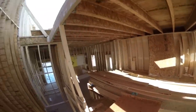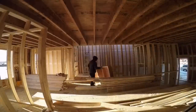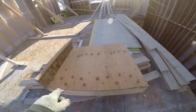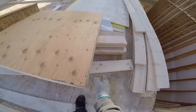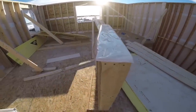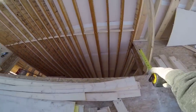First I got to grab that and throw it up there and then I'll put my stick out of the wall and drop it down from the top. So it's gonna sit just like this. This side will go against the exterior so I have to put fire guard drywall and then poly on it. I'll put that on and then I'll nail a block on there to hold it and then I'll drop it down. Now I have my poly and drywall on there. So this part here is gonna be 14 inches — I need to measure down 14 inches from there and that'll be the bottom of the landing.